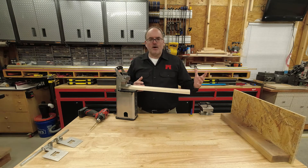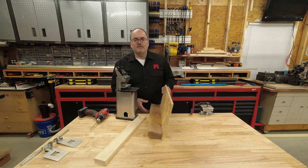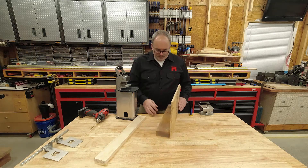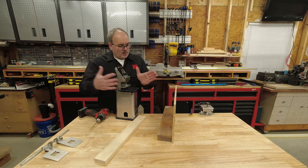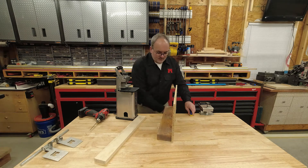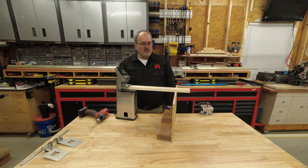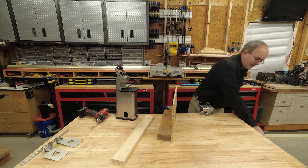However, if you've got longer stock or you've got panels, one of the easiest things to do is make yourself a support. This is just out of scrap plywood and scrap 2x4. We're going to position this off the center of the machine, kind of even it out so it overhangs the side of the tabletop just a little bit. If you can imagine that as a long piece, you can see how nice and easy that's going to make it. Let's grab a panel and see how that works — it makes it super simple to cut your pockets.